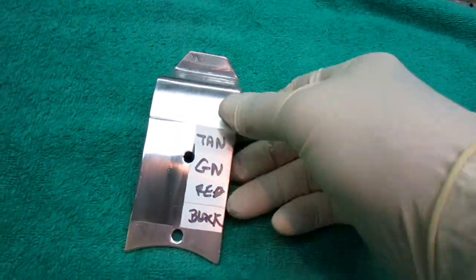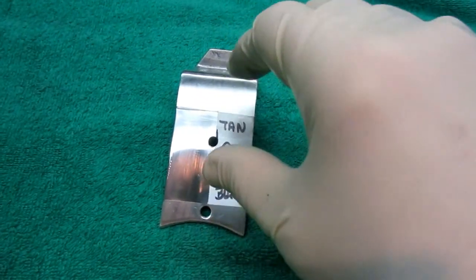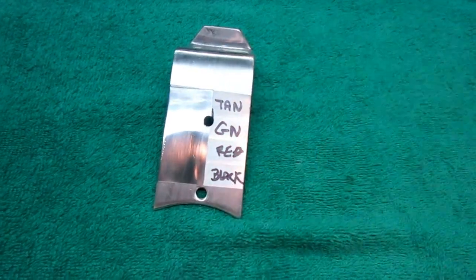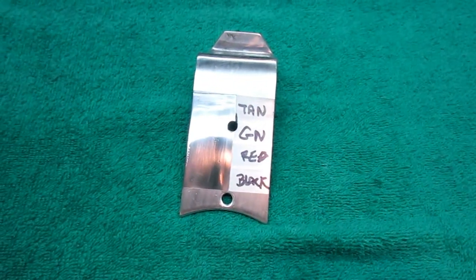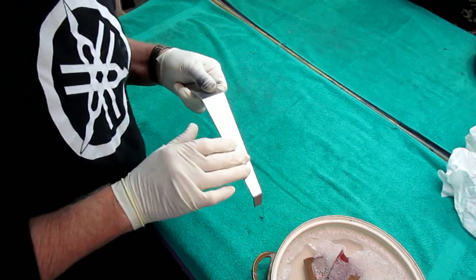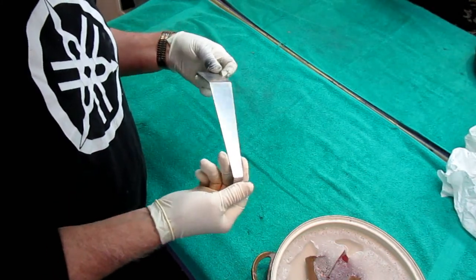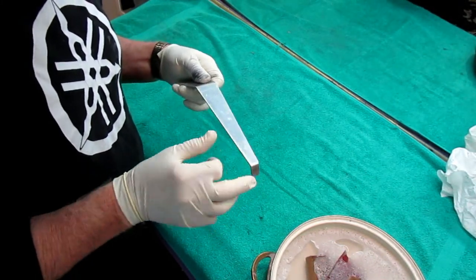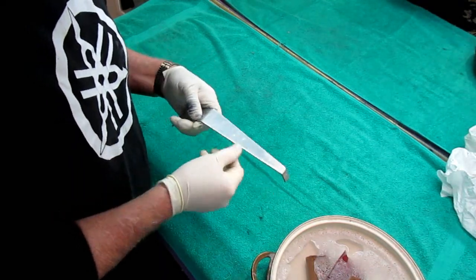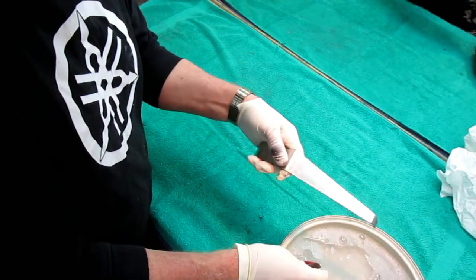Now, that only covers, and I wanted to do this in pieces, that's soft Lowe's aluminum, basically not an alloy. Now I want to try it on a piece of alloy aluminum, which will be just a little bit different. Now this is a piece of aluminum that I used to manufacture when I was a partner in Joe Cassie's machine shop. We used to make these. They're model airplane landing gear. They're aluminum 7075-T6, a very hard grade of aluminum. Probably one of the hardest grades you would normally use.